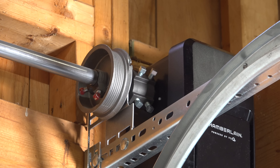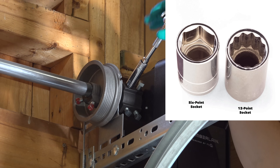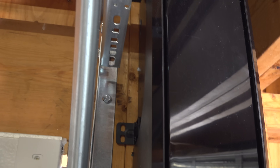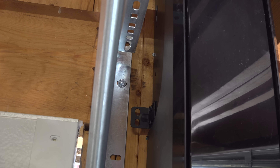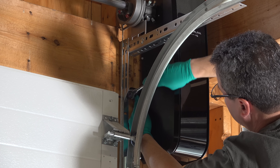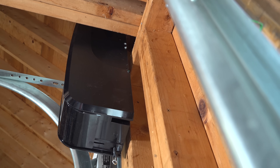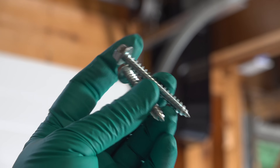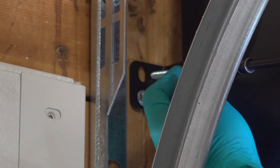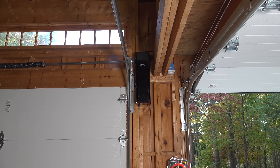All these openers use square-headed drive screws. These can be a little confusing, but a simple way to put them in is to use a 12-point socket. If you don't have one, you can just slip a wrench in there and take a little more time to tighten them down securely. Next, the directions say you should level the opener — it can be leveled toward and away from the wall and also left and right. Because it's clamped onto the pipe with a coupler, you can only move it so much, but this bracket slides back and forth so you can level the opener correctly to the wall. With it looking level, just tighten that bracket to the wall. They include beefy screws in the kit, and I'd recommend using your impact setting if you've got it. This is all that's required to securely mount this thing to the wall and the drive rod.